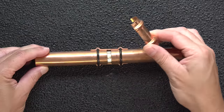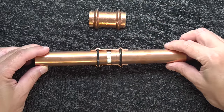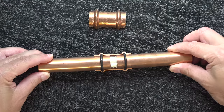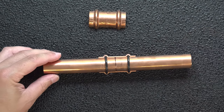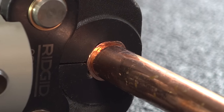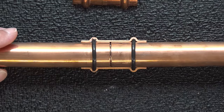They've each got an o-ring inside, and the belief is that over time they would never last as long as solder. Then last week I heard something I couldn't believe: they said the ProPress fittings don't even need the o-rings to make the watertight connection. It's actually the metal-to-metal compression that creates the seal, and the o-ring is only there to catch anything that might weep or drip out.